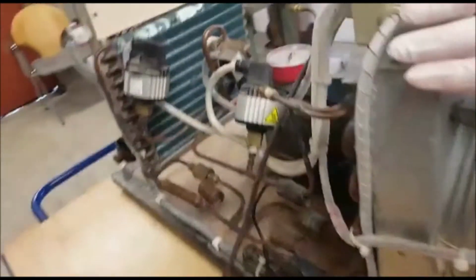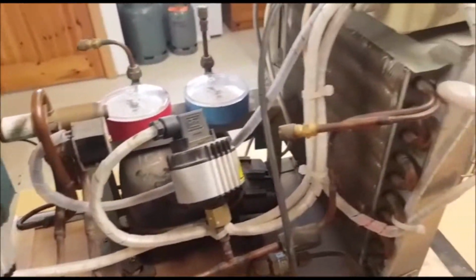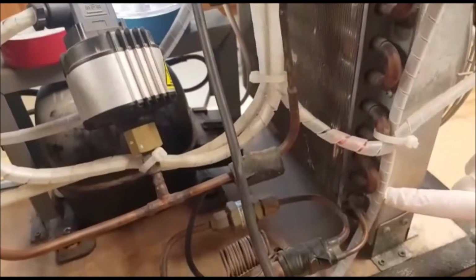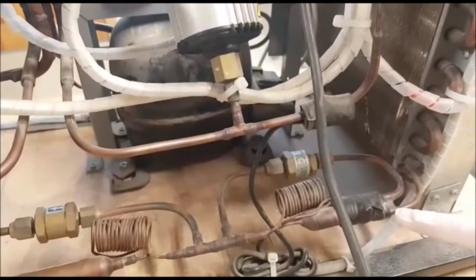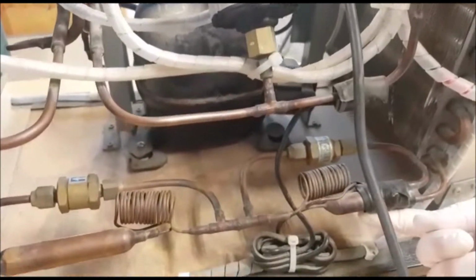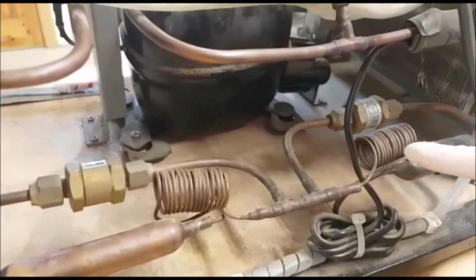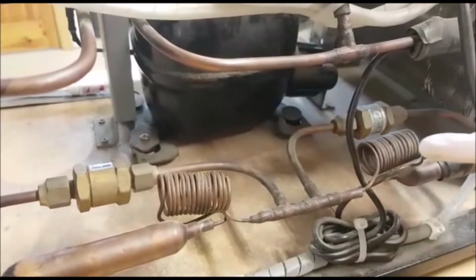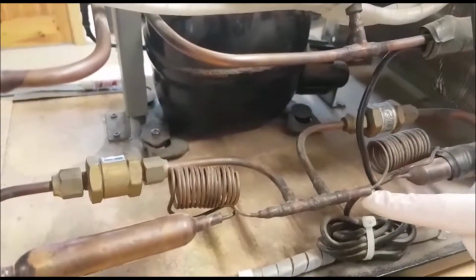So what we now find is that we have a typical condenser, the outdoor coil. It's now on cooling mode: de-superheating zone, condensing zone in the middle, subcooling zone down along the bottom. High pressure, high temperature, subcooled liquid leaves the bottom of your outdoor coil and enters into the filter dryer. This here is a pencil type filter dryer, and on the outlet of the filter dryer we have our capillary device fitted. So this is a capillary tube. This capillary tube is creating the pressure drop. So we're going from a high pressure, high temperature liquid to a low pressure, low temperature liquid at the outlet.